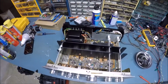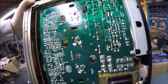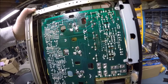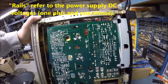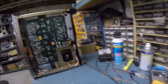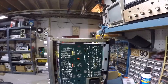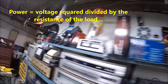I've removed the bottom panel. One thing I like is that they label the circuit board components. The main thing I want to look at is the capacitors — I'm going to check the voltage across them to determine the power supply rails. From that we can calculate the absolute maximum power it could possibly put out. I've just measured the rails and each one is about plus and minus 47.5 volts open circuit, no load. Let me grab a calculator and run some quick numbers.